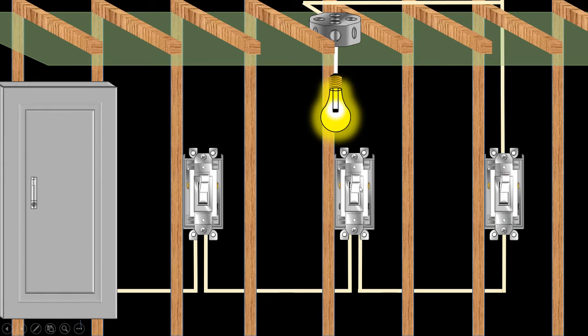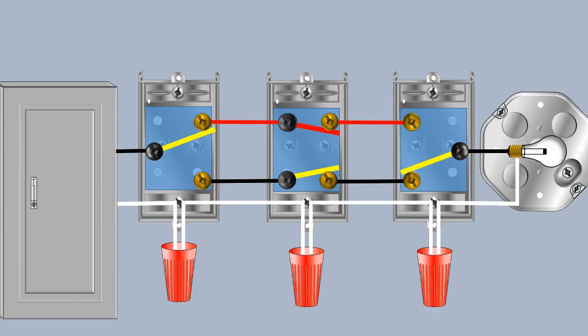So let's take a look at what happens inside these switches. We'll break it down again back into our wiring diagram. You can see we still have our two three-way switches at either end, and in between this is a representation of what our four-way switch looks like. If we really break it down, if we think about this black common screw and these two travelers, and then this other black common screw and these two travelers, it's kind of like we have two three-way switches connected in here, but they operate a little bit differently.